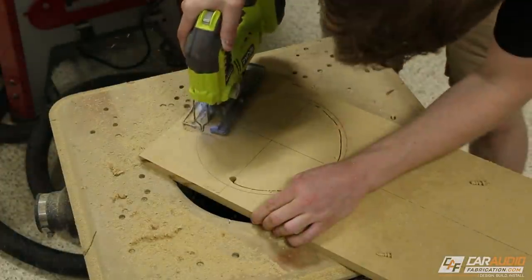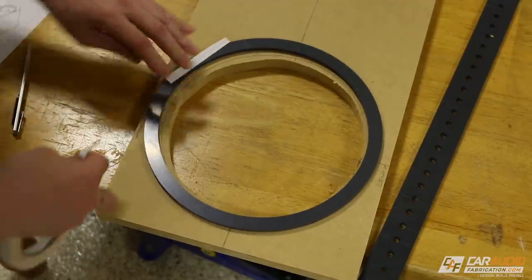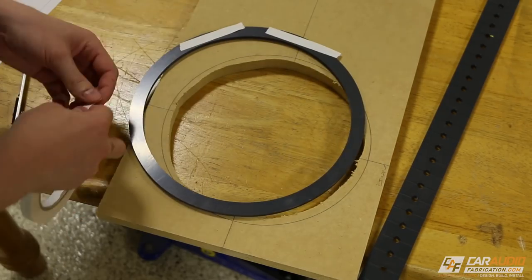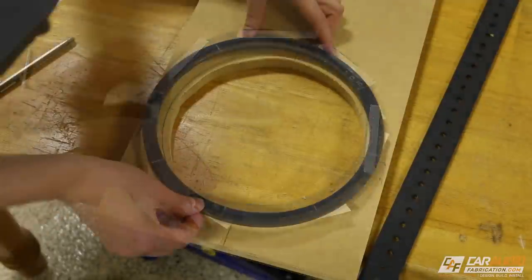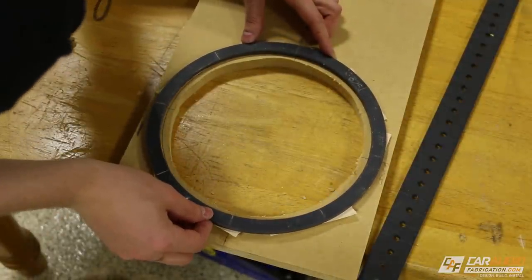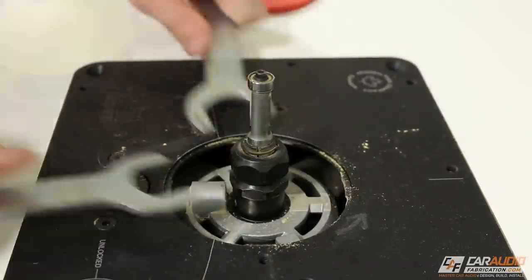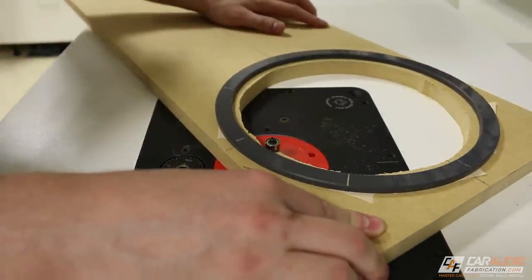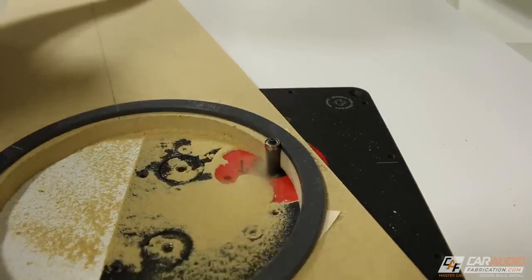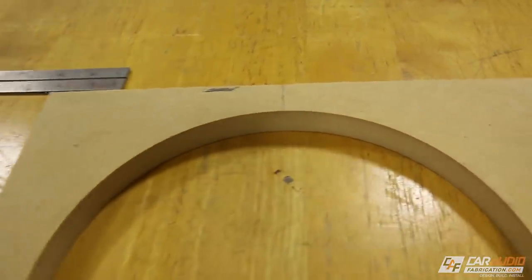If you don't have a woodworking router, I recently made a video about how to build a subwoofer box using only basic tools. I'll be using this circle smart template from my show sponsor Mobile Solutions to make the cutout hole. I start by using template tape to stick the template to the back side, then stick the template and tape assembly to the workpiece. Over at the router table I grab a flush trim bit — the bearing on top rides against the template and transfers that shape to the bottom piece, so it's important to adjust it to the correct height. Once I fire up the router I make a cutting pass completely around the template shape, leaving an extremely accurate cut.